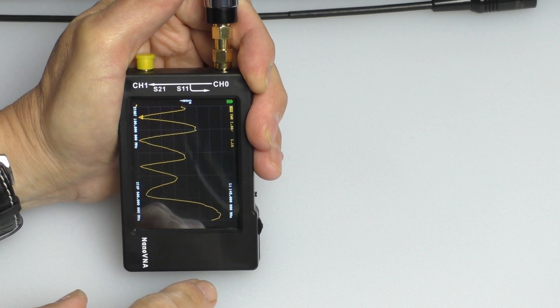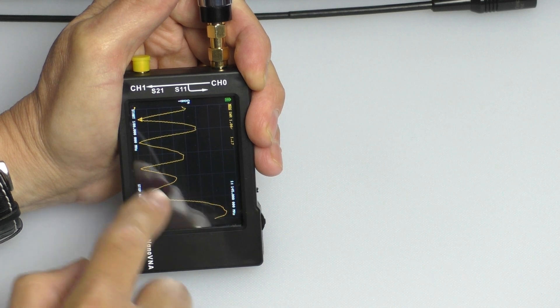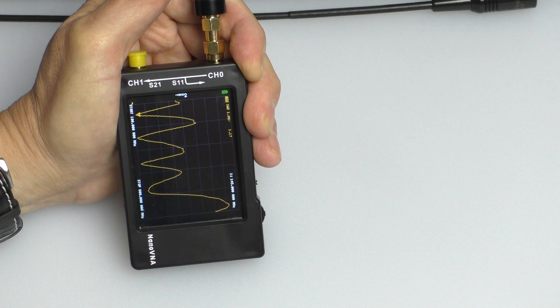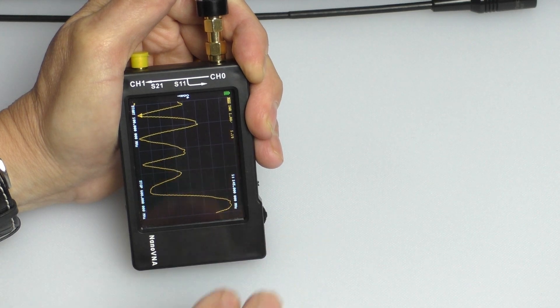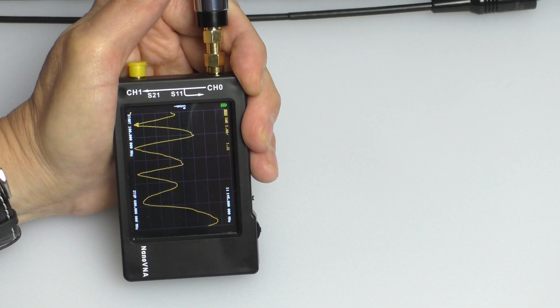As they recommended, with the antenna fully extended at 145MHz, the SWR reads 1.17. So it depends on what band you're using — two meter or 70cm. 446MHz is just a bit higher up, but it is a large antenna once fully extended.